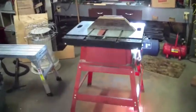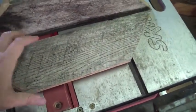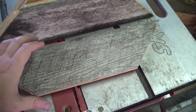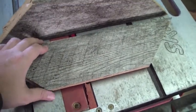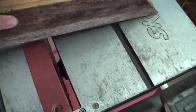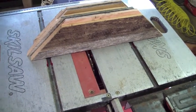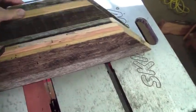The other thing I did today: I have some old barn board — it actually was on a shed — and I went ahead and cut off four pieces. I ripped it down from about 10 inches wide to just a little bit under four and a half inches wide. It's a little thicker than I really need, but I'll leave it where it is for now. I rabbited the corners out on the inside so I can drop in some glass or a mirror. Most likely it'll be a mirror — I might cut some glass and do a little etching on it, maybe a western cowboy hat or something simple like that.